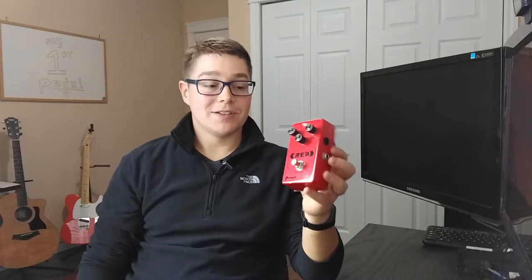The tone control is not really a bass-to-treble — it's really just a treble cut knob. I built it into a 125B case. At the time I didn't really know there were different size cases — this is back in 2012, and I don't think the DIY pedal community was as large. I didn't know you could order different sizes, so I went with what looked most similar in size to a Boss pedal I had at the time.